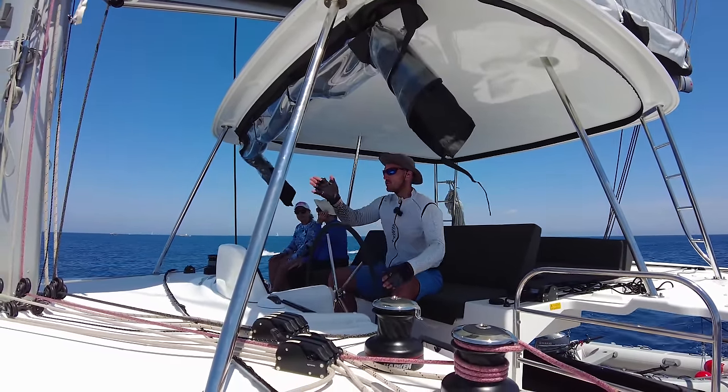And then once most of the thing is ready, you see there's still a lot of things to do, but the best thing is to turn downwind. Because right now going upwind, we have more wind, we're going against the waves, everything is bouncing. But as soon as you can, you should turn downwind, go with the waves. It's going to be much less spray, a calmer ride, and then you can finish all the ropes that you have to do.